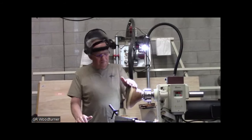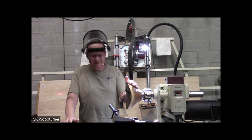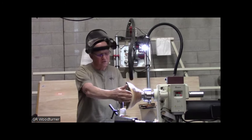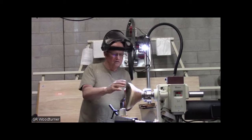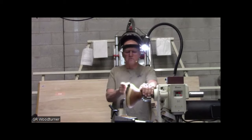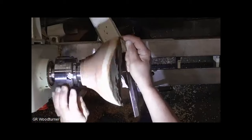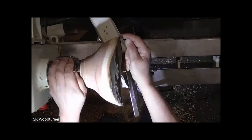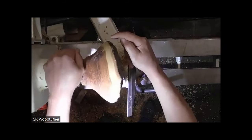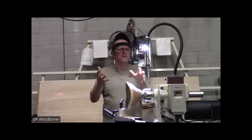All right. Now, before I start hollowing this, the main concern, or two concerns, one is your knuckles, because you're going to have high points and low points. You can also see that this is fairly well balanced. The high point, if I set myself up here to show you, high point right there. If I run it around, the high point's real close to the same. Same with the low points on opposite sides. So it doesn't look unbalanced or crooked when it's finished.